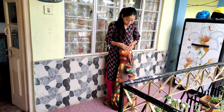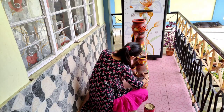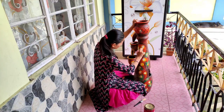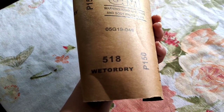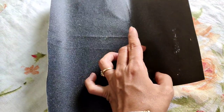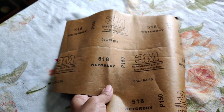First, I will clean it with the help of a brush. After cleaning, I am using sandpaper because the material this fountain is made from will damage and the old surface will be removed. If I apply paint directly, it will not adhere properly.